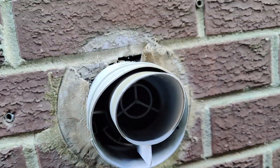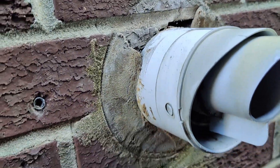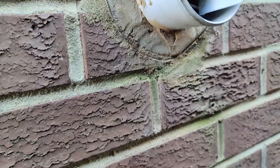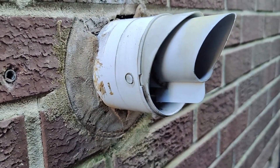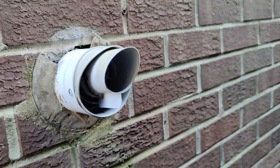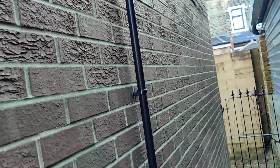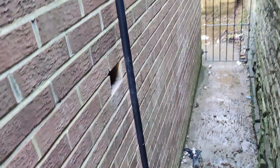About to take out this flue now. I've made a little pathway for myself. The flue needs to be fully sealed and cemented around - as you can see whoever's done it previously hasn't done a very good job - but that's good news for me: it'll be easy to take out, and we may be able to reuse it since it's not going any further distance. That pipe is an overflow pipe coming from the cylinder above, so we can easily just relocate that - it's not even going into a gully or anything, it's just sitting there. We can just shift that slightly away from the flue itself.